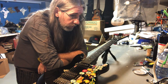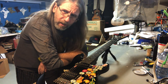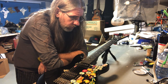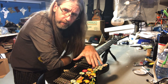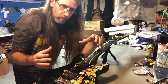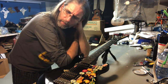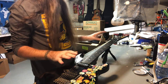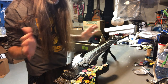You've got your furnaces running, and they use up humidity because fire is dry. So when the temperature drops, humidity drops. Wood is susceptible to humidity — as it gets drier, wood becomes drier and will compress, like a sponge on a microscopic level. You see this mostly on newer guitars, because older ones have already been through it.